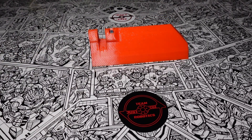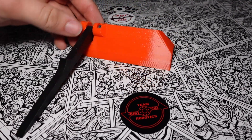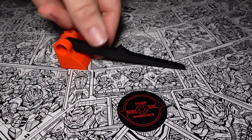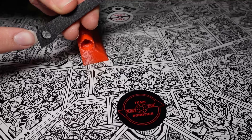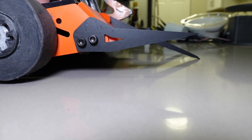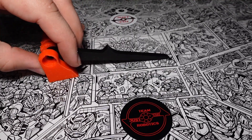Paired alongside the forks — I'll show with a short fork for reference — there's a little shoulder bolt that goes in right here and tightens up against this 10-24 nut. These are actually the same exact shoulder bolts I'm using for the linkage arms on my new robot Shrapnel. Basically the idea is that this hinge here shouldn't be able to go back too far because eventually this flat sticking out the back will bottom out, so it can only angle up to about here and then not go back any further. It's able to angle down quite a bit below the base plate of Division, so that even when it's gyroing while turning, these forks can scrape the floor and prevent another bot from easily getting under me every time I'm turning around.